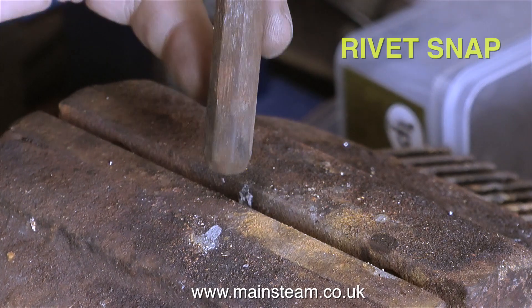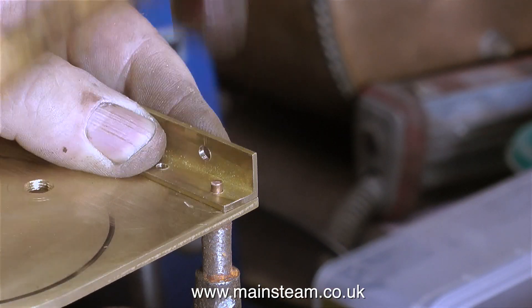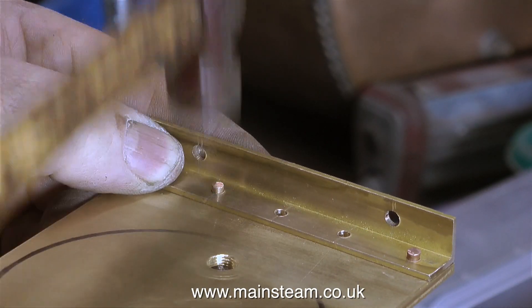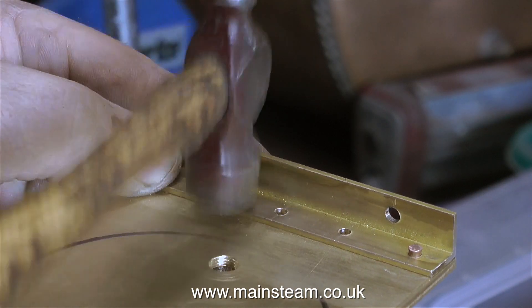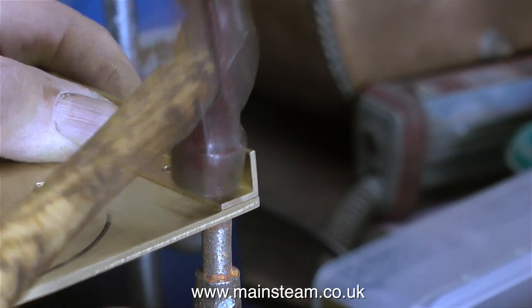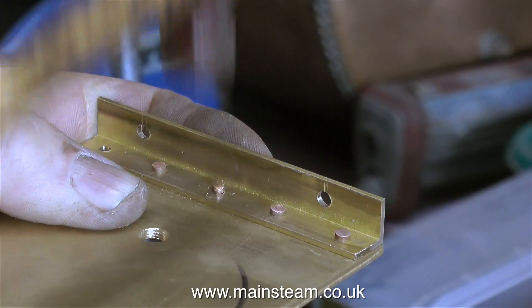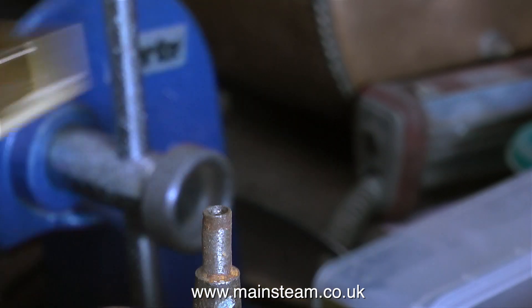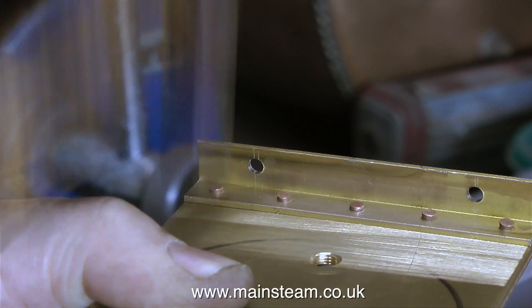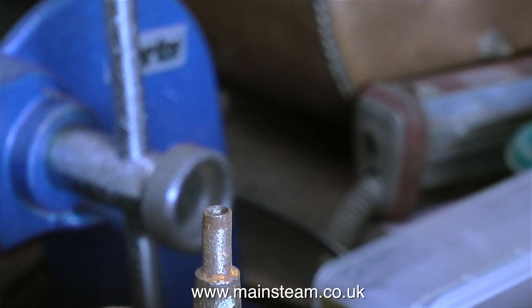This tool is called a rivet snap, and I'm currently fitting it in my vise and tightening the jaws securely to hold it. There are different ways of riveting — sometimes you need two rivet snaps if you want to form a rivet head on both sides. In this application, all I need to do is carefully flatten one end of the rivet using my small riveting hammer. This needs practice; when you first start riveting you will find that you hit things like your thumb and bits of the angle, so do practice before you do anything you want to keep. As you hit the rivet with the hammer, the rivet expands and holds the pieces of metal together. Riveting this way is not quite as neat as using a pair of rivet snaps, but it's slightly easier for the beginner.